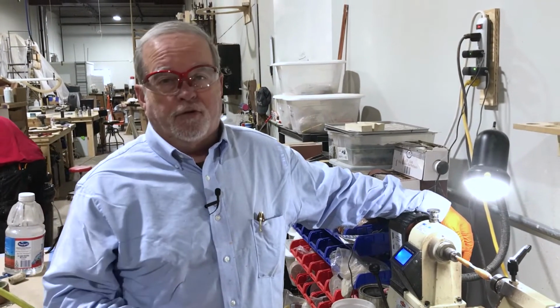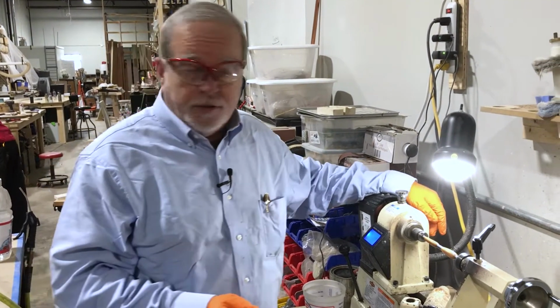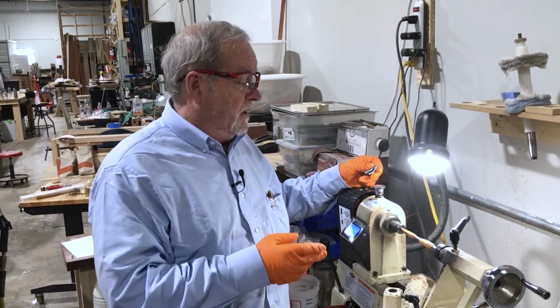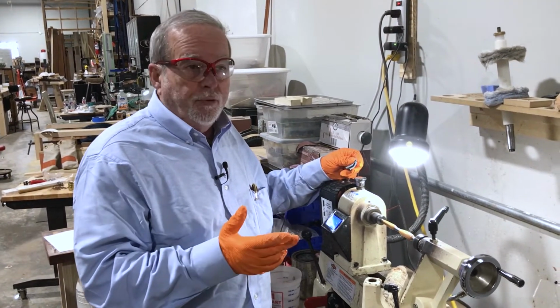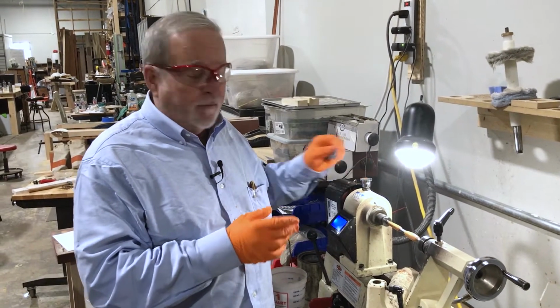So you need to make sure that they're all dry in between coats. And the best way to do that is to use the activator. Just want to use it sparingly. So it's okay with me that I've got some of the finish that I can actually feel on it now, because I'm going through 9 more grits of sandpaper before I finish.